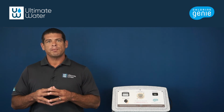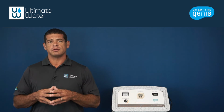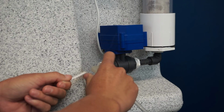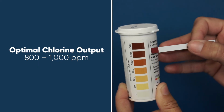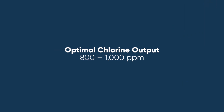To validate the inspection and cleaning has fixed the cell, you will test the chlorine production of the unit. Wait for 30 minutes with the unit running for the cell to prime and then disconnect the Teflon tubing below the chlorine output on the ball valve. Using a chlorine test strip, ensure the output of the unit is producing 800 to 1,000 parts per million of chlorine. If so, the cell has been successfully cleaned.